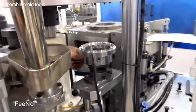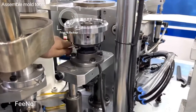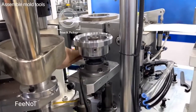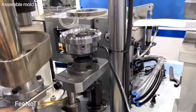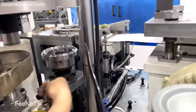Here is almost in the center part because here is adjusting the location. We do not move. We only adjust the height. So sometimes the customer later, because this one is not in the center, you should loosen this one, two, three bolts, another side, three bolts. One, two, three, another side bolts, and adjust the location. And move left and right, four sides moving.